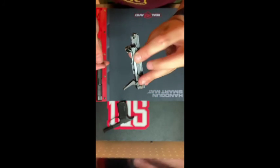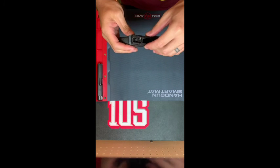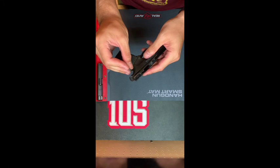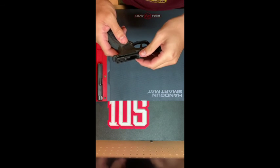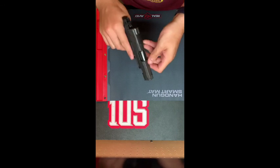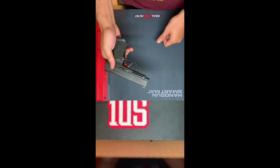I'm going to pull the trigger now — let's see the movement. And then this is the completed FCU — fire control unit. You have your grip module here. You have to make sure it seats on the forward end first and the back end slides in. Take this retaining pin and push it right in — there is a little retaining clip on the FCU so it cannot walk its way out. Take your slide, reinstall it — and now it's reassembled.